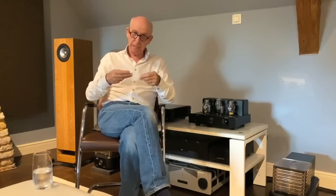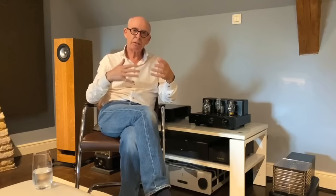If you haven't got an electronics expert nearby, get your hands on a very cheap pair of loudspeakers — maybe you've got some around, or go to a secondhand shop and pay no more than 10 euros. Plug your amplifier into those first. Switch it on and power it up, then see what's happening: are the drive cones moving in and out, or are they stationary? Is it making noise when you switch things? If it all seems fine, then put a source through it and make sure everything checks out before connecting to the Sibelius speakers.